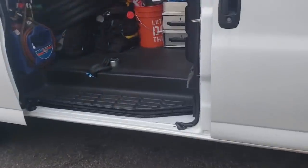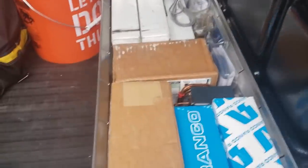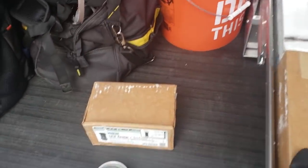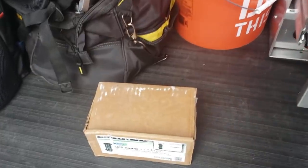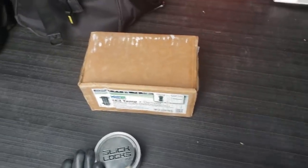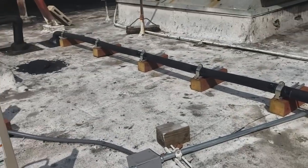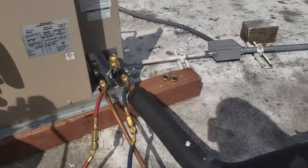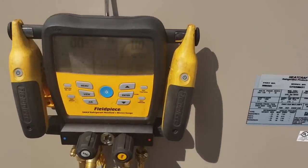It's kind of nice when you can have your vehicle right out here to get your stuff. I've got a temp control right here along with some cord. We're going to put a KE2 Therm temp plus defrost on this bad boy because it's just a walk-in cooler. We're slowly moving along. We've got a line set ran and the evaporator hung. I just got done piping it.